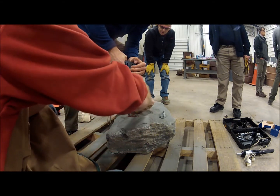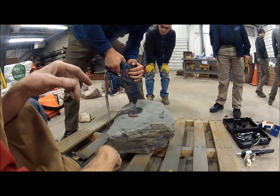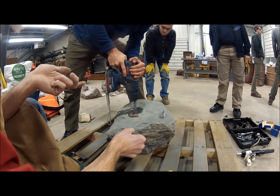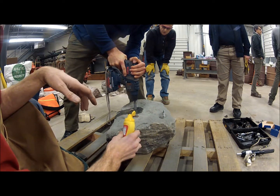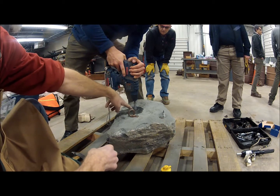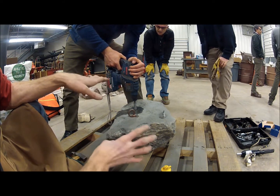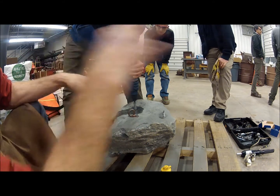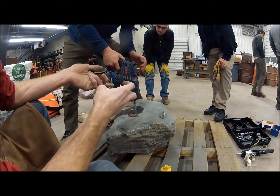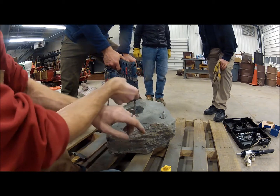You can tell I haven't generated a ton of heat — otherwise we'd see steam coming out of there. So pull back a little bit more — that's probably enough, that's probably damaged it enough. You can see the water's boiling. If you go much longer than that, you can denature the metal because you'll get it above 1400 degrees. The metal will turn — you'll see blueing on the steel if you successfully get it out. But you're changing the tensile strength of the steel if you get it cherry red.